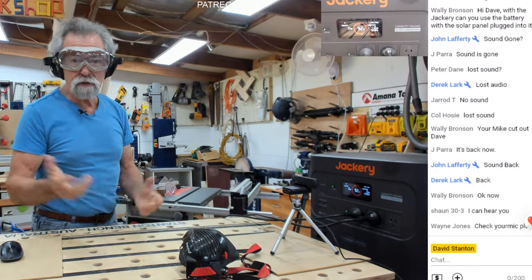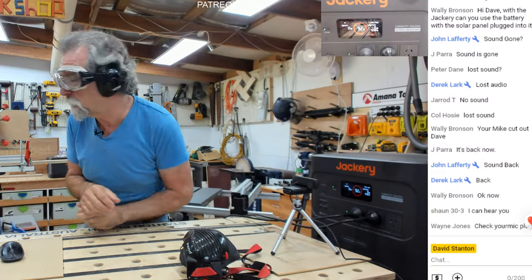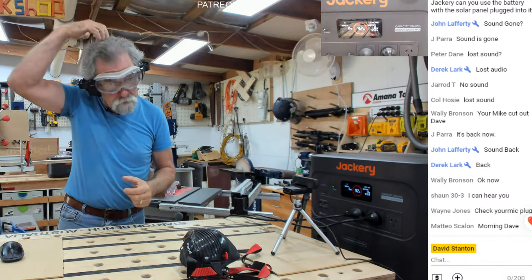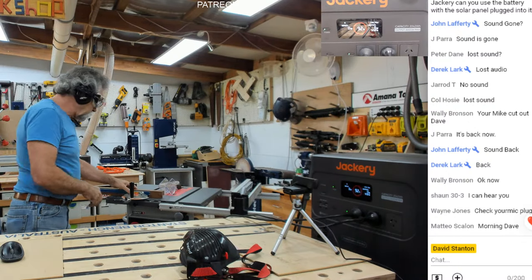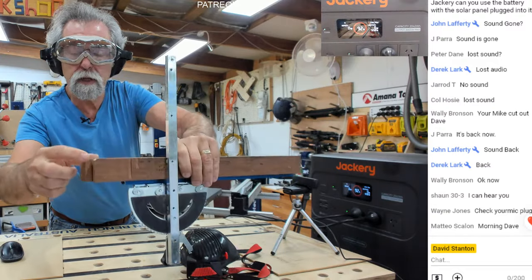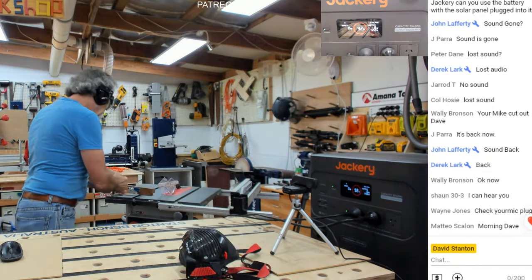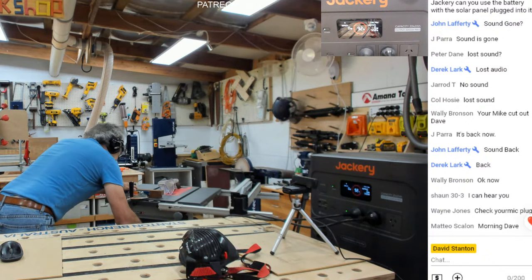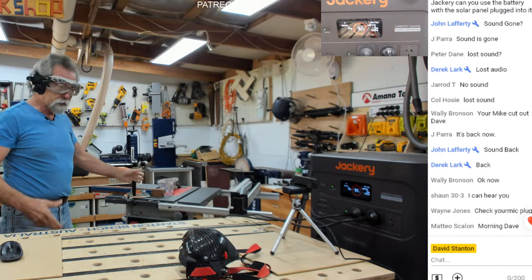How easy is that? And that's so comfortable. Styling. There we go. Round to the other side. Across the top there, no dust is going to fall down there. It just lands on the top here. All right, we're going to cut the end off this guy here. Now, I use this as a sacrificial end when I'm cutting on the table saw or the router table. I'm going to pop it on here, wind this guy up a little higher. I have the rip blade in, but it's going to do the job, okay?